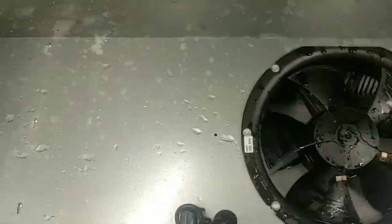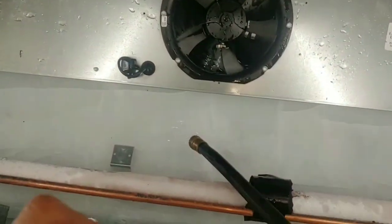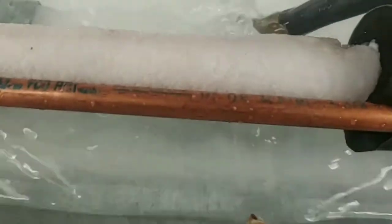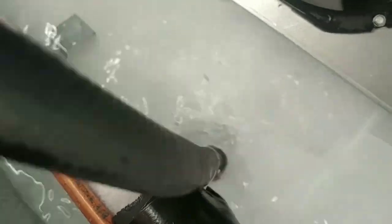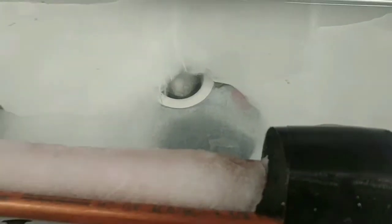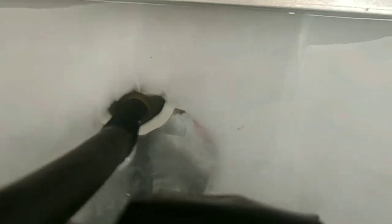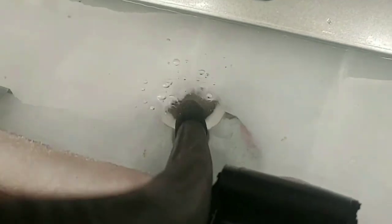I've got a frozen case fully iced up because we have a plugged drain. I'm gonna take my hot water — this is where the drain is right here — clear out the drain, get the ice out of the way, and then blow out the drain. Hopefully we should have water draining. I'm gonna clear the ice out of it and try to force it clear.